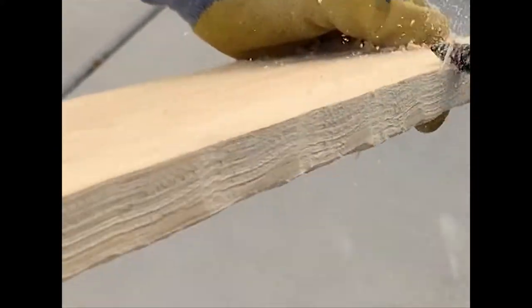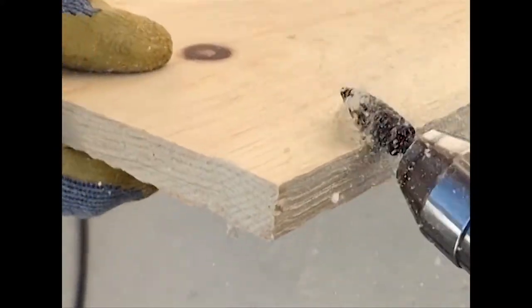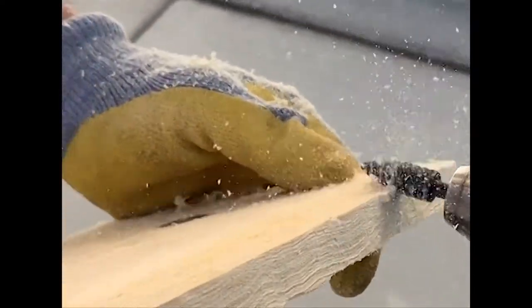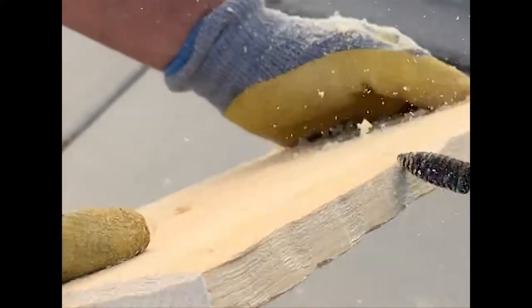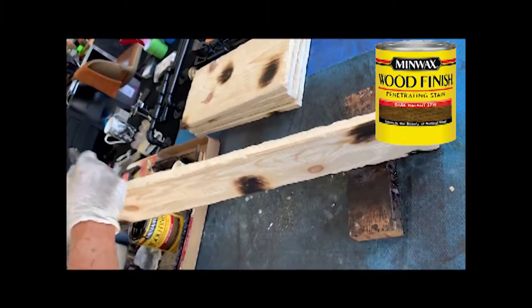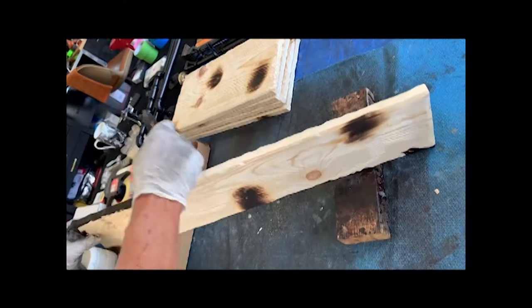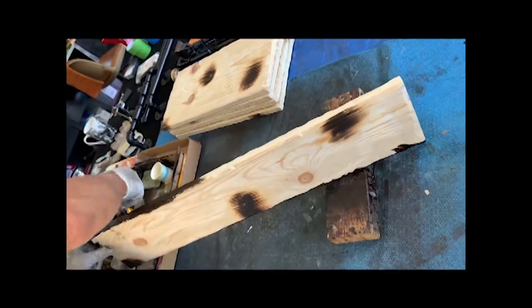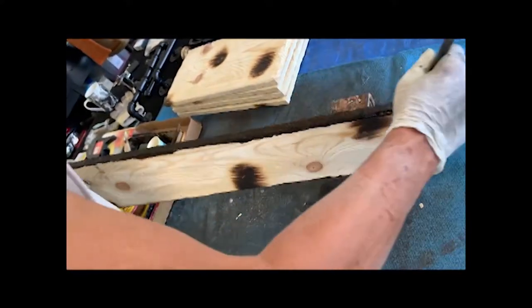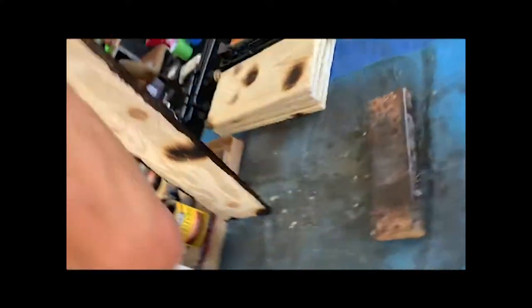Basically we like to have kind of a weathered rough look on our boards, so we take a couple steps to make the new board look almost as if it's old. You can do this with a lot of different tools around your house, so don't feel like you have to buy expensive tooling. I chose Minwax's Dark Walnut Finish after distressing the wood, and you're just going to apply one coat of this to the board. Boards act kind of like a sponge, so a little bit goes a long way.